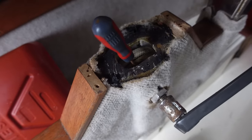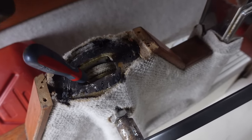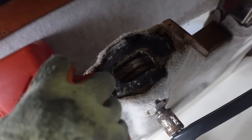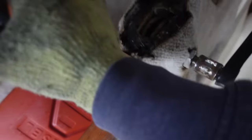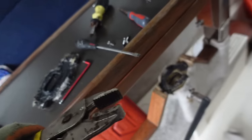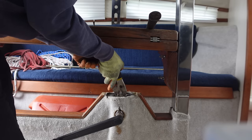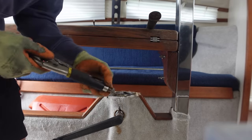I'm deciding which way around to drop it out - whether in its down configuration it'll get past this bar here. So we've got a screwdriver in there and give it a bit of a tap. I think that's through - if we pop the other one we should be able to rotate. On the video they said when you pop the pin out it kind of rests on the top of the centreboard, so let's try to rotate it and get it out. You can see how it's sticking out now, so I'll get my mole grips and just give that a pinch - wind it in, maybe about there. These are the best mole grips I've ever had.